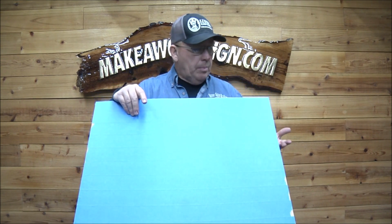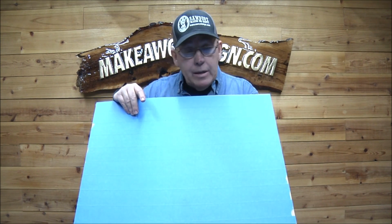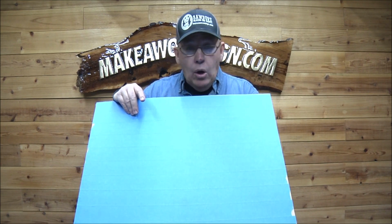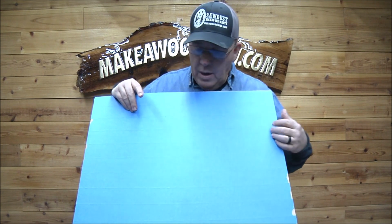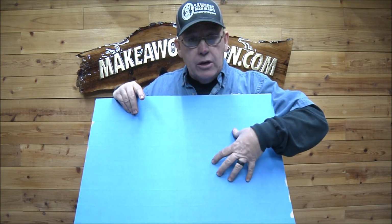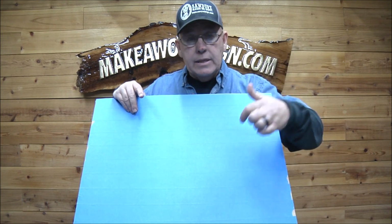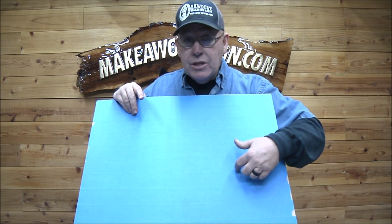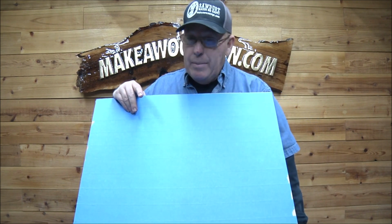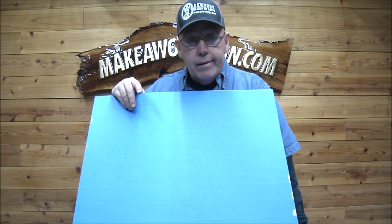I consider this a plywood. It is a type of plywood, but I'm not going to do any sanding on it. That's all up to him as far as painting and all that. So I'm hoping to be able to get the layout down on top of this tape. I'm going to cover it with packing tape and then carve through the packing tape, through the painter's tape, and just score the board. Maybe a 1/16 inch into the board. And we're going to see how it comes out.